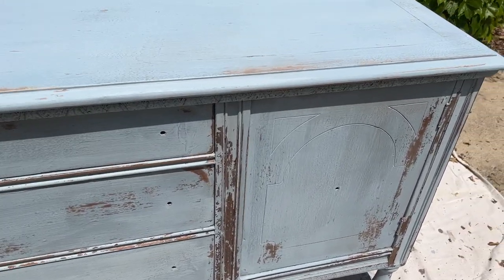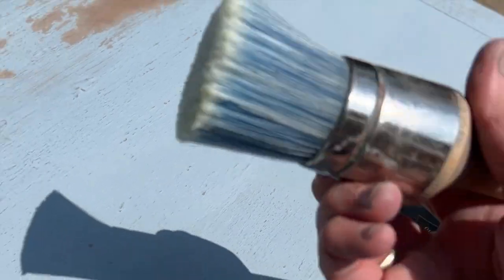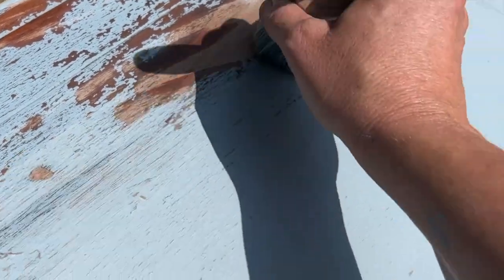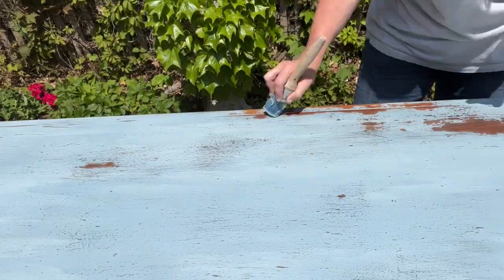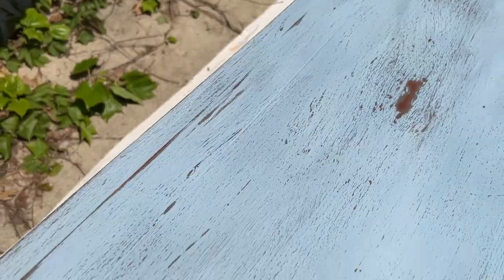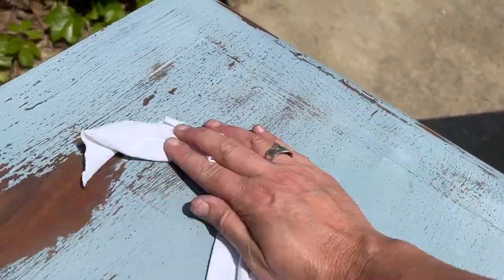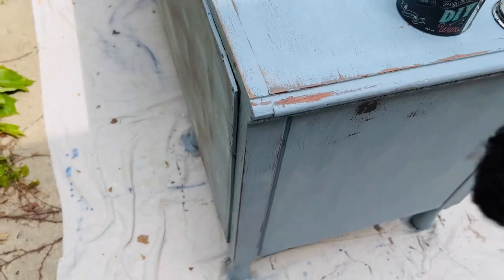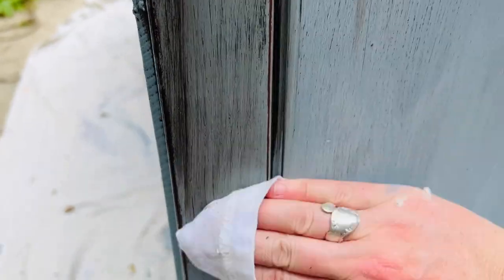After I was done with the sanding, this is what it looked like before the wax was put on. Then I applied a coat of DIY Paint's clear wax to the entire piece, using a soft cloth — I like to use old t-shirts — and wiped off any of the excess wax. If you wait 24 hours you can do that again and buff it to a slight sheen if you'd like. I also used a little bit of dark wax from DIY Paint — not over the entire project, but just select areas, then wiped it back. That dark wax sits down in those brush strokes and cracks and really helps give it an aged look.